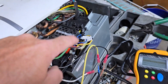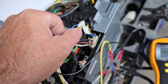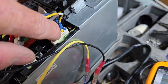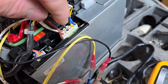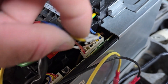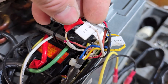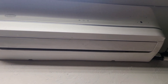It's awesome that I had spliced this back together when I was done with it. It's hooked back up because this is your indoor motor — DC high voltage between common and red — and then you have your 15-volt supply, a zero-to-six speed signal wire, and then your feedback, which is probably the blue. So the white is the 15 volts, the speed signal, and the blue is the feedback.